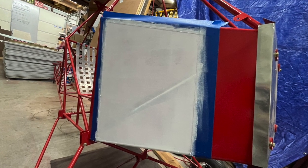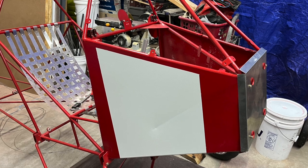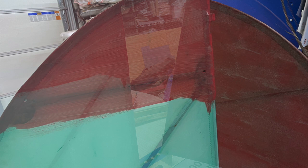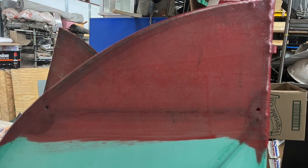I guess in the aviation world, 1 cross coat is actually 2 paint layers. One north and south, let's say, and the second layer is east and west. That's 1 cross coat layer of paint. Well, to this country boy, that's me painting my plane parts 2 times. So however you want to look at it, every other time you paint, just swap directions of your strokes. With that being said, the first takes the longest, and then each layer thereafter is faster and faster. You'll really want, especially those first couple of layers, to get the paint down into the weave of the fabric. This will make the physical bond needed for your paint job to adhere well.